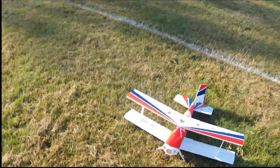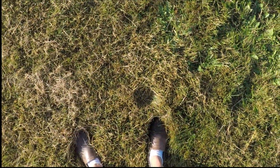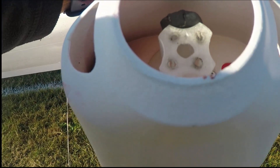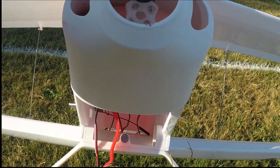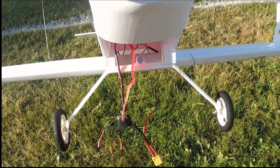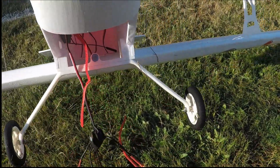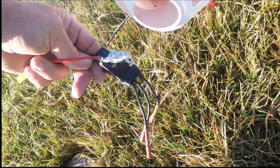I think what happened is the motor mount got really hot and the screws pulled through — you can see that the mounting screws pulled through. The question is the power — do I just go with a little bigger motor? This one flew well, but could definitely use a little bit more. I was using PETG on the motor mount and it got hot. Something was going south — probably the ESC. It wasn't the best ESC, so I'm going to definitely upgrade.